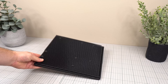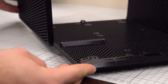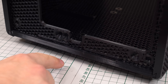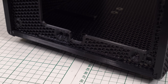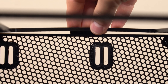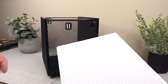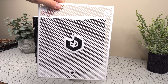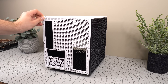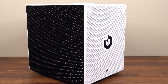The coolest part of this design is how all the parts fit so seamlessly together, one part sliding into the other. The panels actually lock into each other, meaning the front panel will lock the three other panels into place, preventing them from moving. The top panel again will lock the front panel into place, with a latching feature preventing it from sliding back out accidentally. The external top panel slides into the same track, followed by a magnetic front panel — and we still have not used a single screw. The only main body part requiring screws is the rear panel, allowing for a super clean exterior with no visible screws.